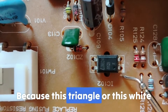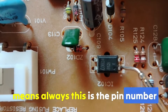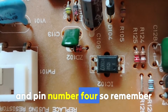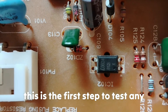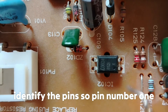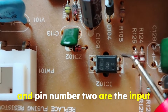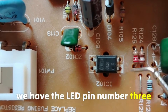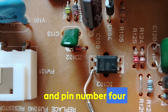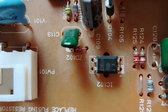The white mark means this is pin number 1, pin number 2, pin number 3, and pin number 4. Remember, the first step to test any optocoupler is to identify the pins. Pin number 1 and pin number 2 are the input side where we have the LED.